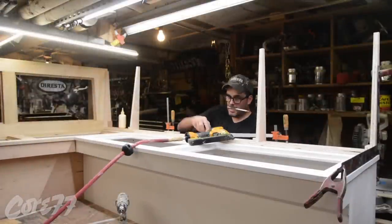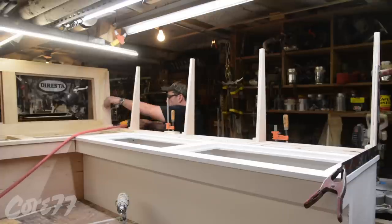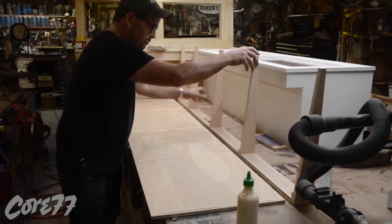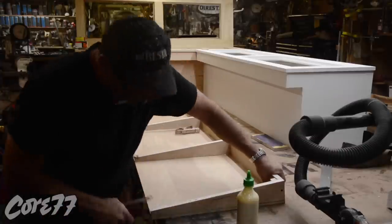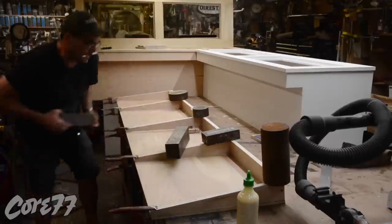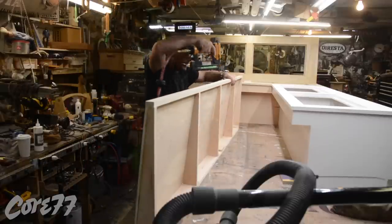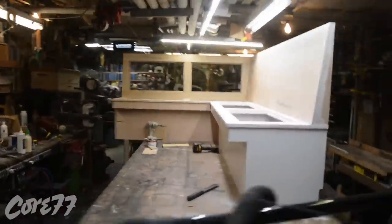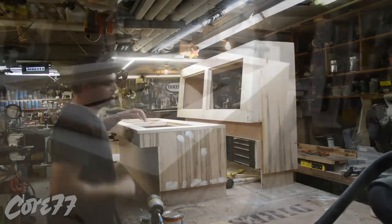On the opposite side there is no storage behind it, so it's just a 5 degree bevel against the wall so when you sit you have something to put your back against. Just like building a little wall, I build my uprights and studs and now I'm gluing it onto the backing. Since it's a difficult thing to clamp, I'm using some steel weights. Now again my hardwood is going right at the cap — I've got nice hardwood everywhere, so in the event it gets dinged or starts to get worn out, the hardwood is going to show and not the end of plywood. Wherever there is an open edge, it's going to be hardwood.